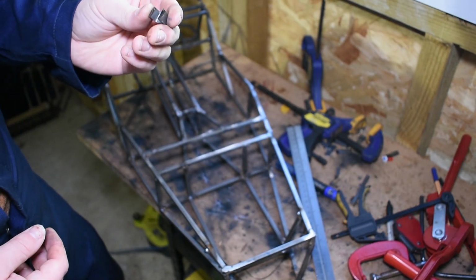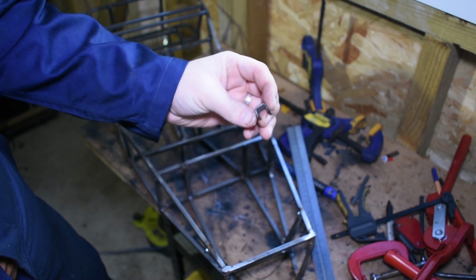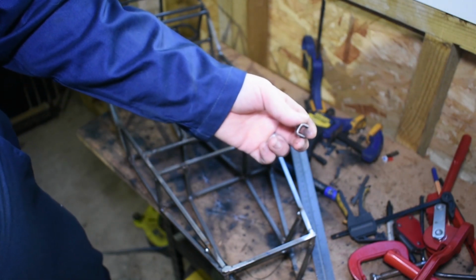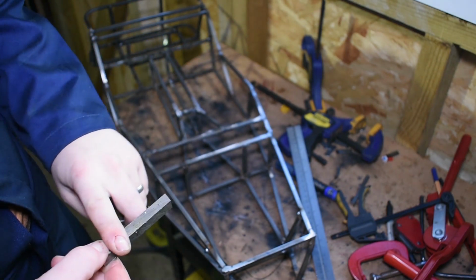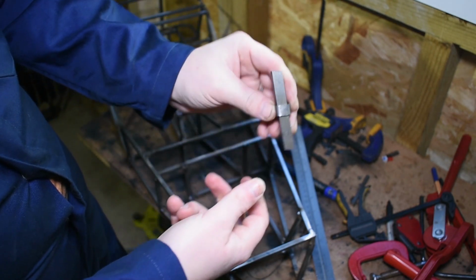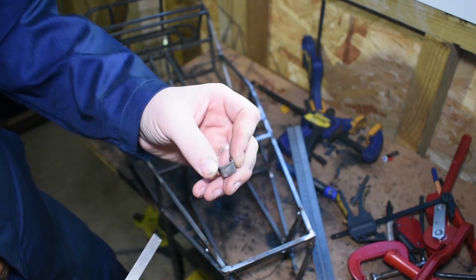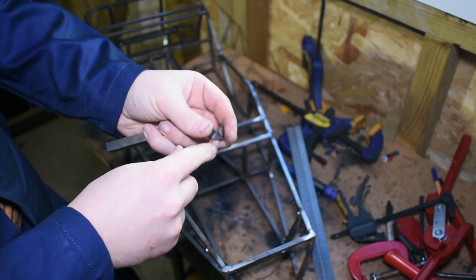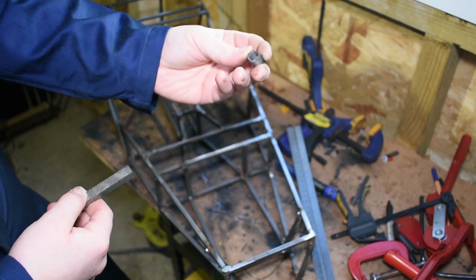So it's the next morning, so I'm going to spend this morning just getting the small brackets made. So I've just been folding these around a bit of high speed cutting steel in the vise. So I've got 20 of these to fold, and then after that we'll be drilling through them with a 3mm hole, which will be what the suspension arms bolt to in the future.